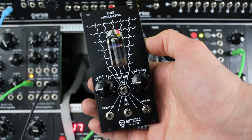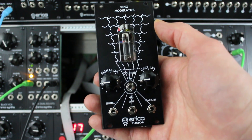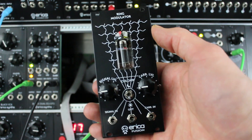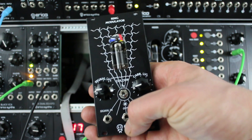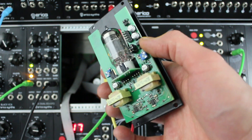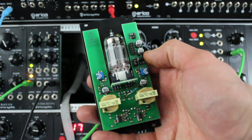Hello world, Kodek here from ixinx, and today I proudly present our MAG2 version of the Fusion Ring Modulator module. The overall sound has been drastically improved and it now features a dark and bright setting which changes the ring modulator circuit behavior. Most importantly, you can now power it straight from the 12V rail without the special tube heater PSU.